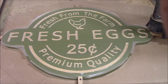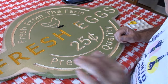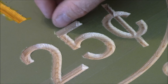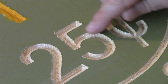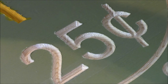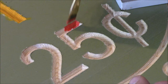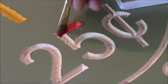That's got it all cut out — next comes the painting. We've already started painting some of this before I remembered to video it. Normally these edges look really good; the contact paper is a bit rough along the edges but the wood looks good underneath. Make sure you press down any loose edges beforehand. I'm using a brush with a little point to it, which helps get into those corners, and just start putting the paint in.